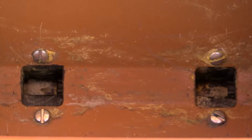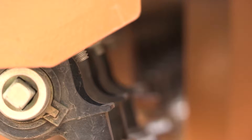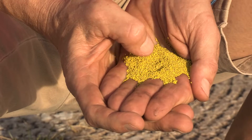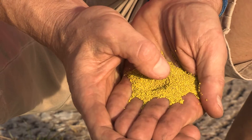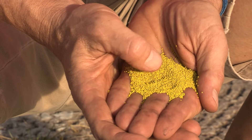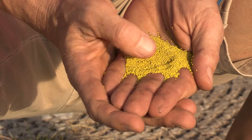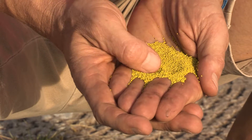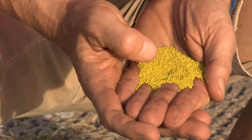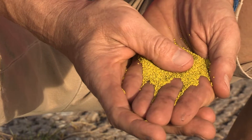Pay close attention to outlets inside the seed box, where seed can easily accumulate in the black funnels underneath the box through which the seeds fall into the tubes. Much of the seed nowadays, like this teff seed in this example, comes coated. That coating material readily attracts moisture. We have seen problems if you leave it in the seed box — if you do not clean it out, it almost becomes a concrete-like substance. So you definitely have to clean it out of the seed boxes to make sure you're ready for the next planting season.